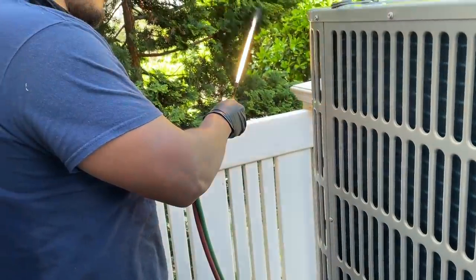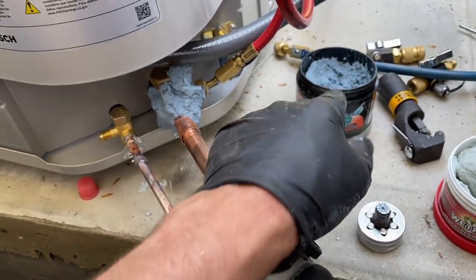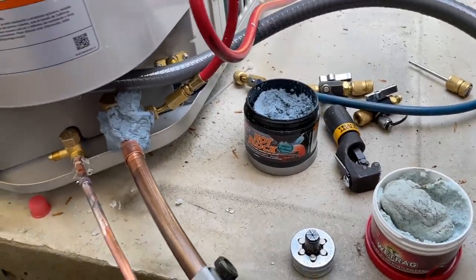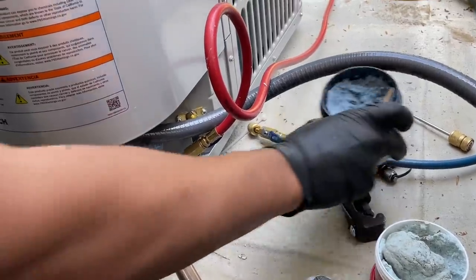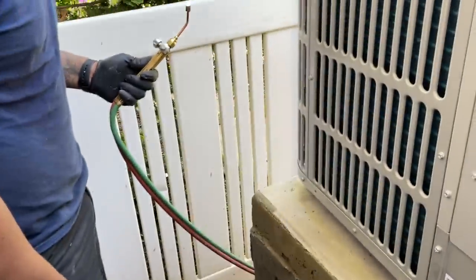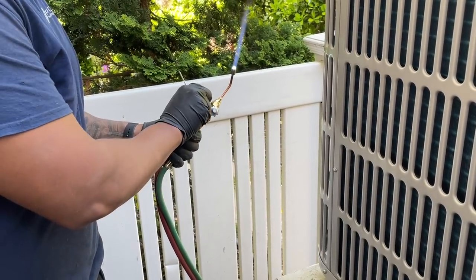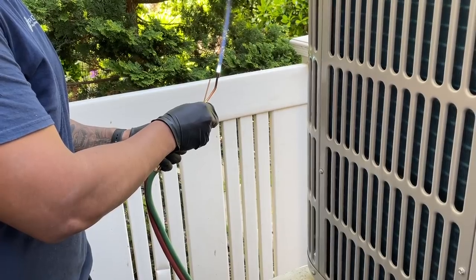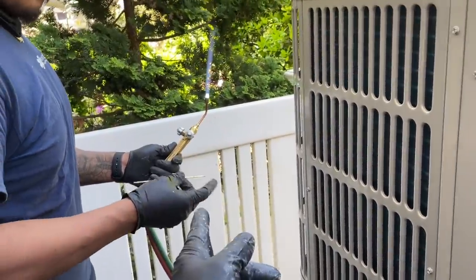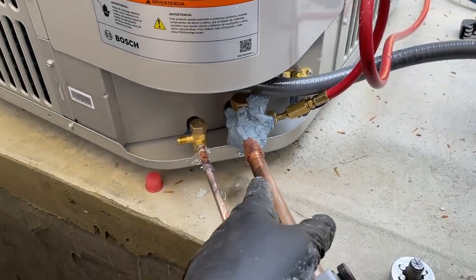For the three-quarter side we're going to use the Hot Block. This came from Eddie at Greenberg Plumbing Supply — a link to his company will be in the description box below. Now we were working on three-eighths before; we're now working on three-quarter — bigger pipe, more flame. Give it more fuel and more oxygen. I'm not — it's the first day using the rosebud tip, so correct me if I'm wrong — thoughts, feedback, criticism down in the comment section. I relocated my nitrogen purge to the low side.